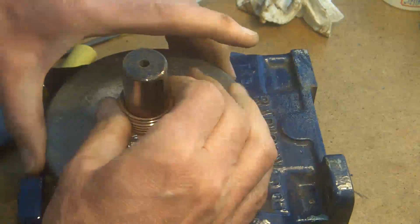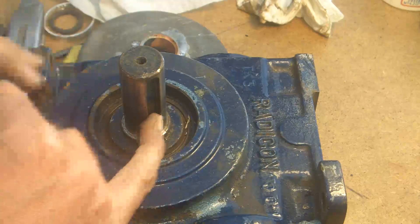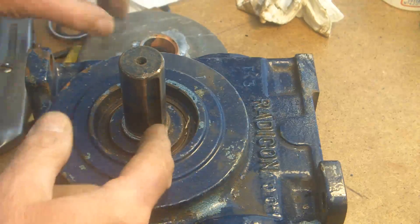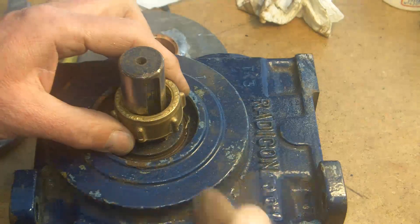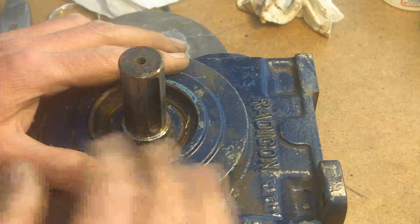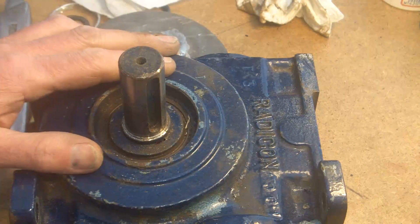What I'm going to do here — and I haven't decided yet — is either fill it with lead or fill it with rubber. So it might be that I find a lump of rubber that's a good tight fit in there, and then with effectively a rubber olive squeezing down onto there, I can say that everything below there is waterproof. I think it's worth doing that just to preserve the life of this gearbox, because the drill and the mast and all of the other bits I can replace inexpensively, but this would be a very expensive gearbox to replace.